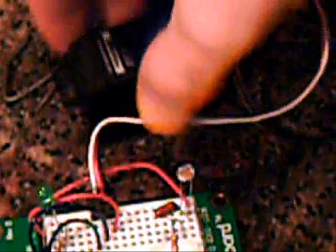You'll see we have the photoresistor right here and the servo right there in the background. I'm going to hold this over for two seconds to activate the main program. After two seconds, once the laser's contact with the photoresistor is broken, you'll see it starts to shoot. I programmed it so it will only fire up to five times, and each time it fires it pulls the trigger five times. After that, the program resets and starts running all over again.